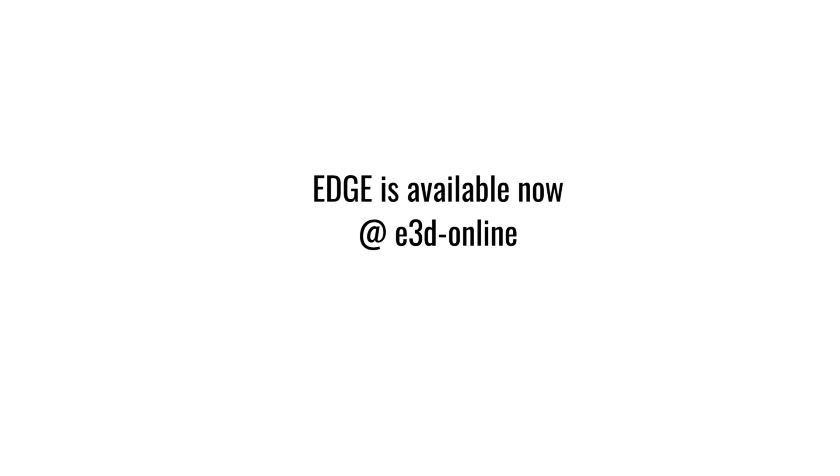Another benefit of using these base resins is that polyesters have extremely high intermolecular forces. In a practical sense, when you put a polyester on top of a polyester they stick — and not just by mechanically keying into one another, you're forming a chemical bond. That means the interlayer adhesion between parts printed in Edge is exceptional, very notably different to something like ABS which tends to pull apart along the layers. With a model printed in Edge, what you're going to see is almost isotropic — i.e. the same in all directions — strength of part, which is a huge step forward.